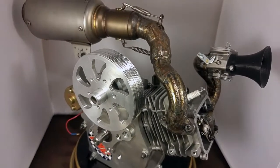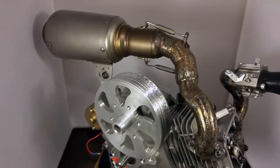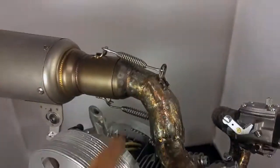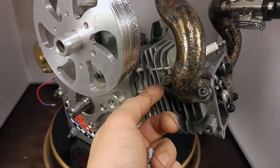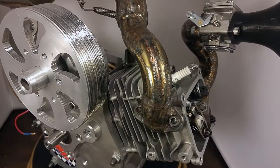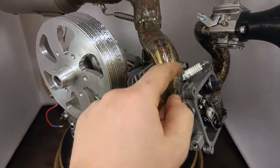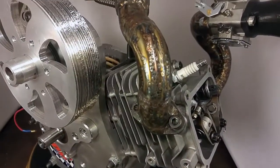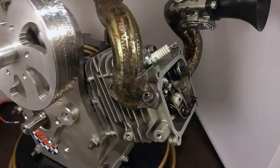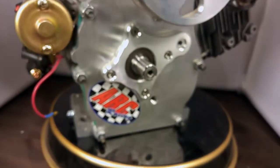The exhaust header is a new one. It's kind of ugly — I really don't like that shape. The problem with the old one is it started out as a one-and-a-half-inch tube, which is actually sized for a wastegate, and it was one-and-a-half inch all the way from the port. You actually need to port match the header so it has better qualities for pulling the exhaust gases and heat away from the engine, making it more efficient. So I switched over to a port-matched header that also matches the intake manifold.